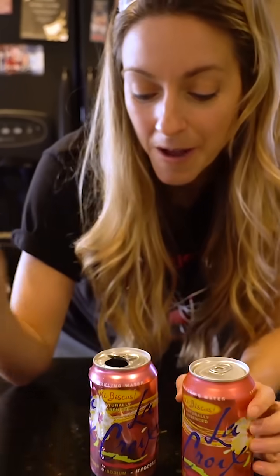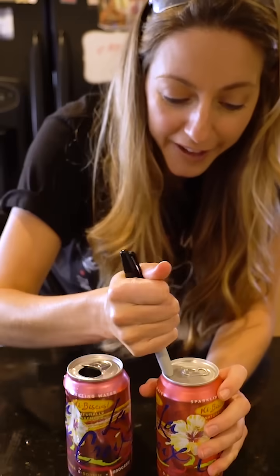Right there the aluminum is thinner, so the material is a little bit weaker there. As we rub the sharpie back and forth across the lip, what you're doing is you're flexing the metal back and forth, and metals have this property where typically if you bend them back and forth like that, they fatigue and they get weaker and weaker.